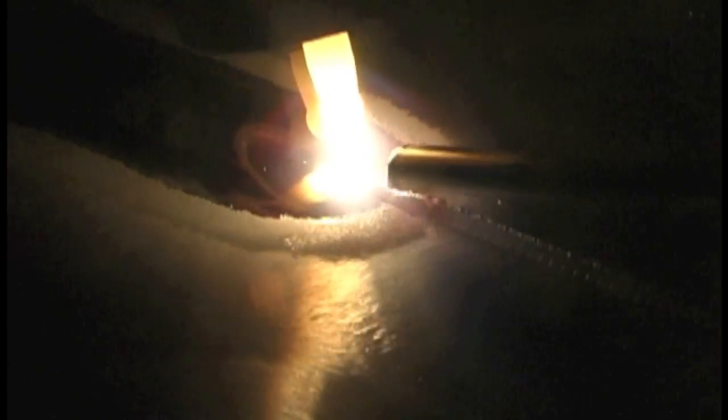Let's shift gears and talk about some informational stuff. I always like to use this step and pause technique, where I move the torch ahead and pause, and even sometimes lift the arc length a little bit to get it out of the way of the puddle when it grows up from the filler. Step and pause is a good technique for aluminum, but it works on steel and stainless steel as well. The reason I think it works well is because you're only using one hand at a time — it's not like walking and chewing gum at the same time.